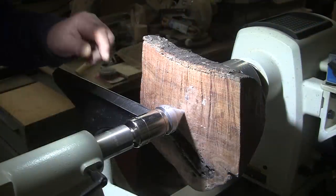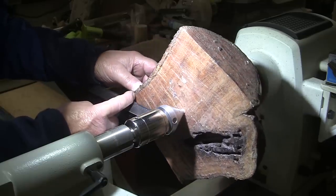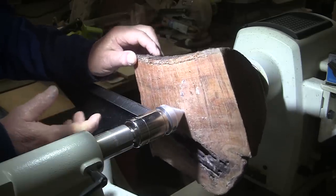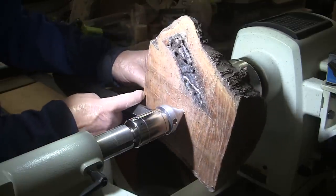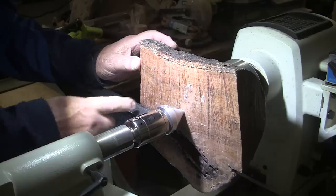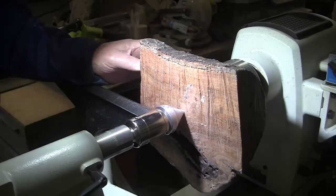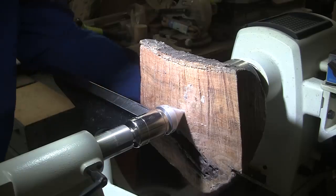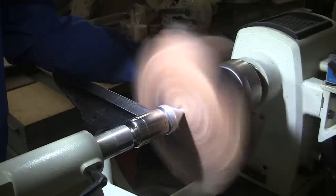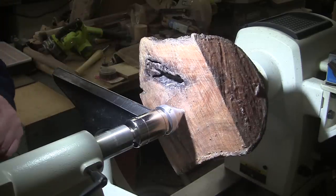I hope I'm not sorry about this — I'm going to flatten the bottom off first. I'm just afraid of peeling that bark off. It is very tight, but stuff happens. There's such a big difference between over here and over here — if I don't do that I'm just going to have a hard time rounding it up on this corner. So I'm going to flatten it off first. We're going to be turning at... I forgot to check. 550. Five-eighths inch bowl gouge, mask and face shield on.